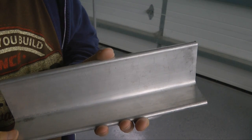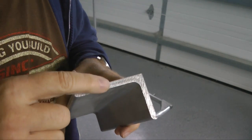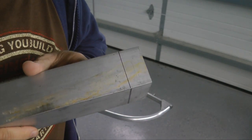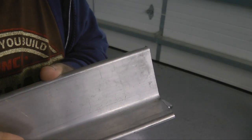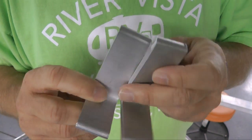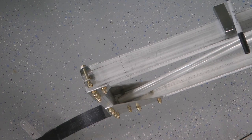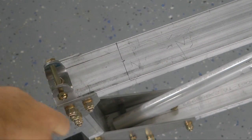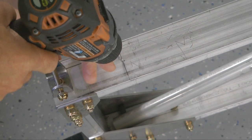We're going to make the bracket from a 2 by 3 inch extruded angle by 1 quarter inch — that's pretty thick — and all we need is an inch of this. On the back I drew a line for my band saw, and we need 2 of these 1 inch angles, so I will cut 2 off of this. With the rudder removed, we use our plans and locate our spot 3 and a half inches from the very back and halfway centered, and that's where we're going to drill our first hole. Mark it, punch it, and carefully drill through the top layer.